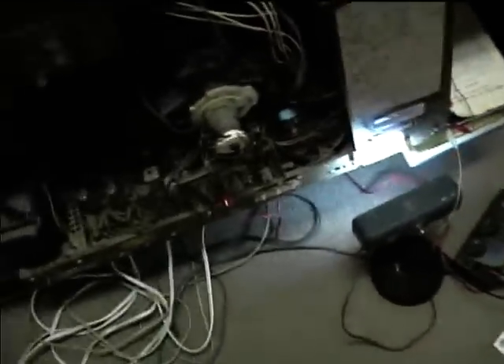I've been measuring the voltages at various points. The cathode and grid voltage at the HV regulator tube are low, and I also measured the boost voltage at the screen controls. The screen control voltage was also low, so I'm thinking there may be a weak horizontal output tube.